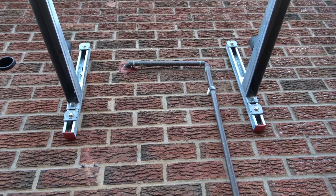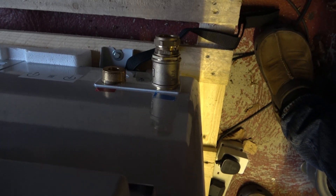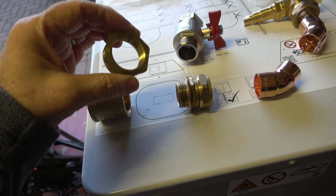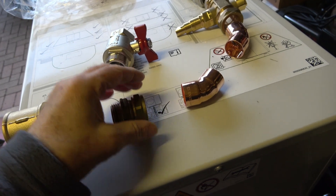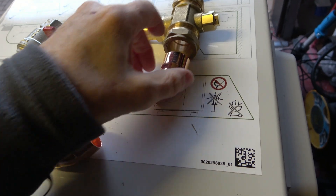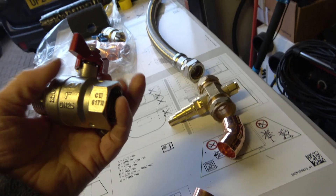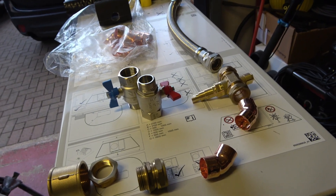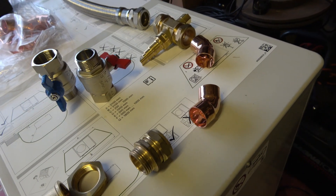So that's the outside work done for now. Another thing to decide is how I interface the heat pump with the pipework. The output port on the Vaillant is a one-and-a-quarter inch G1¼, so I plan to put on a one-and-a-quarter inch socket, then a one-and-a-quarter to one inch reducer, then one inch to 28mm compression, 28mm pipe at 45 degrees, then another 28mm pipe at 45 degrees, then the freeze valve, and then the flexes. I don't want isolation valves on the outside of the building — I want them immediately as we come into the garage, and that's simply for heat loss. So that's the plan unless I can be convinced otherwise.